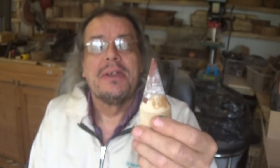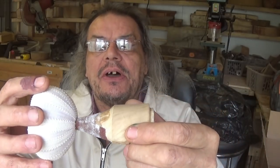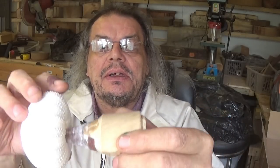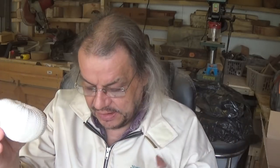The next thing, I made myself a little cone. This is down to Cindy Drozda again, a little cone with some sandpaper on, fits in the chuck, and then you can sand the holes perfectly round, make them a bit bigger if necessary, and being a cone it'll do all the sizes. So I'll have to make one of those, but that's no problem.